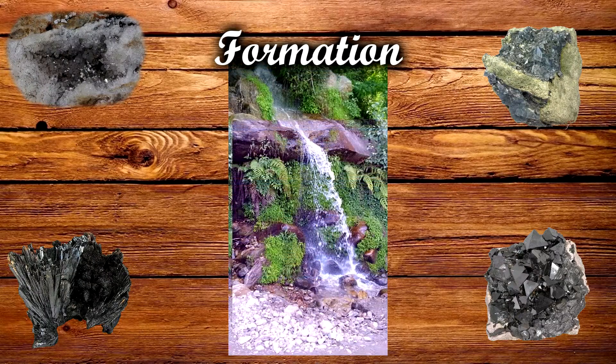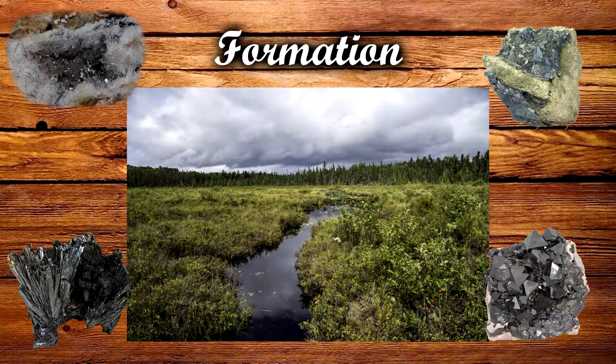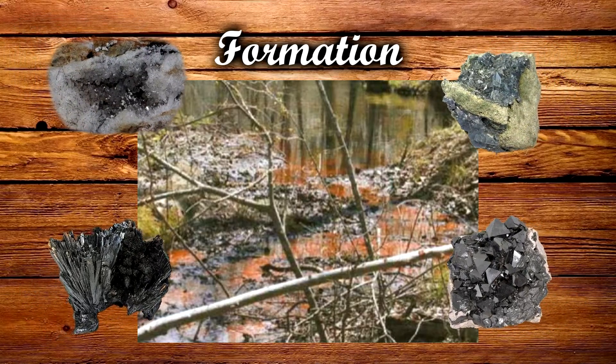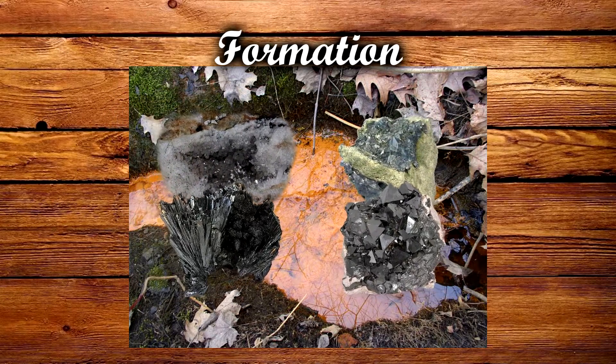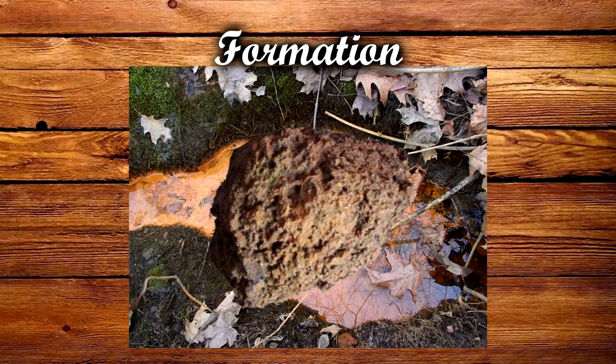The iron and other minerals are brought to the bog in streams, wherein they were dissolved in the water when the water travelled underground before they reached their springs. There are two main factors that play a part in the creation of ores from these dissolved minerals. The first is the acidic environment of the bog, which has a low concentration of oxygen — these are the right conditions to create iron compounds that won't re-dissolve into the water. Secondly, and perhaps most importantly, there are anaerobic bacteria living just under the surface of the bog, and they concentrate iron as a part of their life processes.